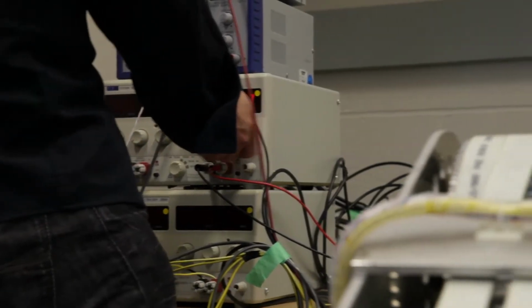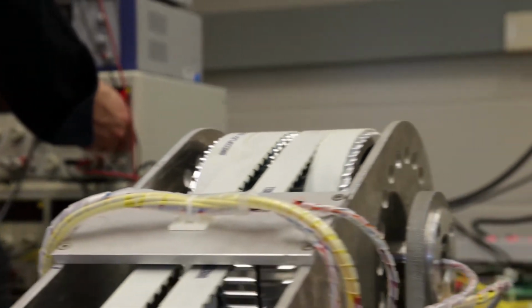In this actuator we used a special type of material called magnetorheological fluid, which essentially is a fluid that can change its viscosity in response to magnetic fields. Now we use this fluid to power the robot as it is needed, when it is needed. In that case, the robot has no excessive torque or force to harm humans, and at the same time, it has enough power to do its job.